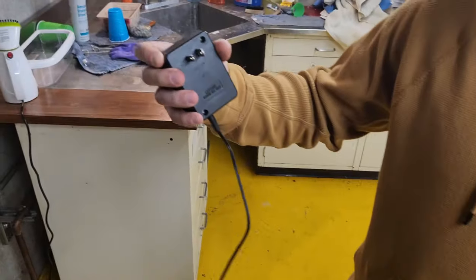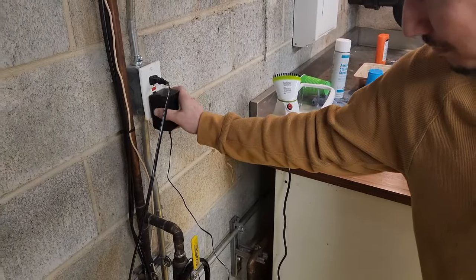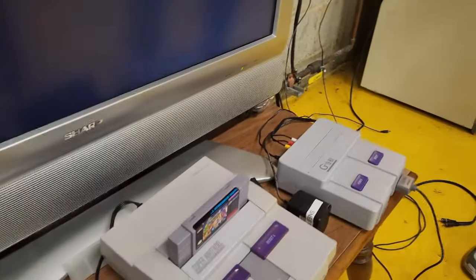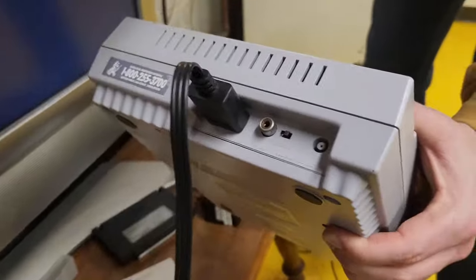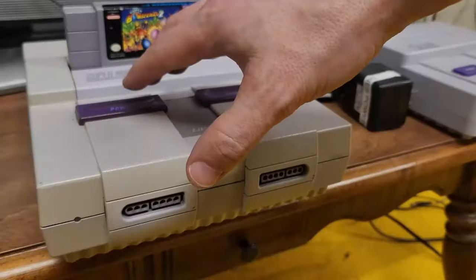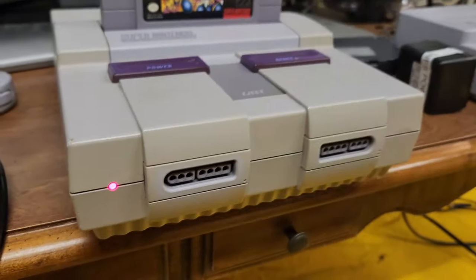The moment of truth has arrived. We plugged it in, hooked everything up — and it didn't turn on. We realized the plug was not inserted correctly into the new cable, because that plug has polarity. You need to make sure the longer leg of the plug goes into the positive terminal. So please make sure to do that when you get these new cables and plugs — if you do, you might just get lucky and get some power!